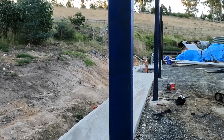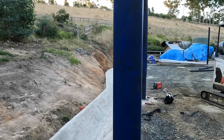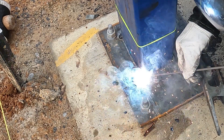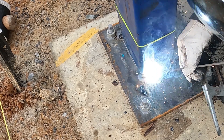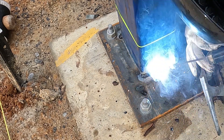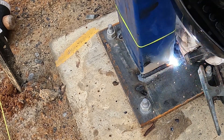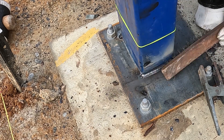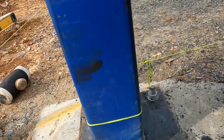That was the last column for that side and they've just lined up perfectly — I was really happy with that. With them all done, it was time to go around and fully weld them. Depending on the beam, the shorter edge is no problem, just welding straight across. But on the longer edge of some of the beams I welded a couple of inches at a time and swapped sides, just to make sure I didn't pull the beam over too far — I really wanted to keep it as square as possible.